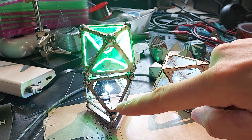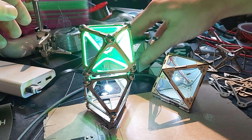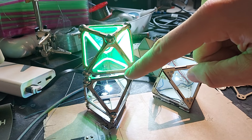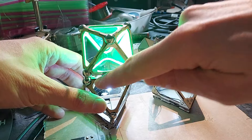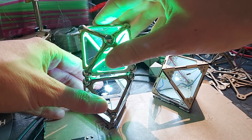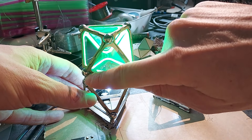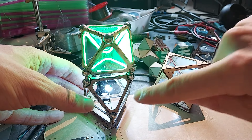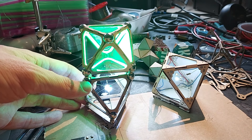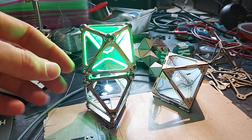Now this one on the left is one of my earlier prototypes — there have been a lot of prototypes, I lost count — but this one is one that I finished a bit more. The idea is that we have ball bearing spheres, and by putting a magnet in between them they attract magnetically. The coating is electrically conductive, so we can use the surface of the magnets and the ball bearings to conduct electricity. Quite an easy solution and it also looks quite elegant.